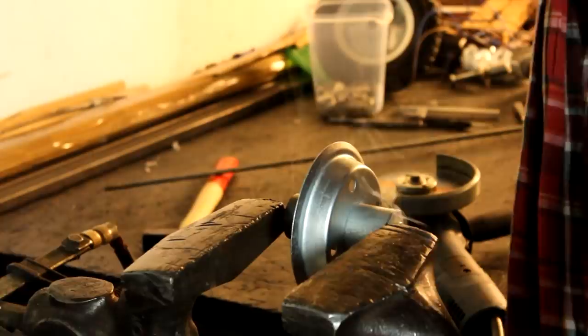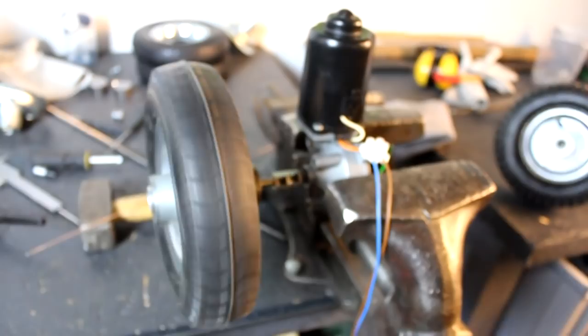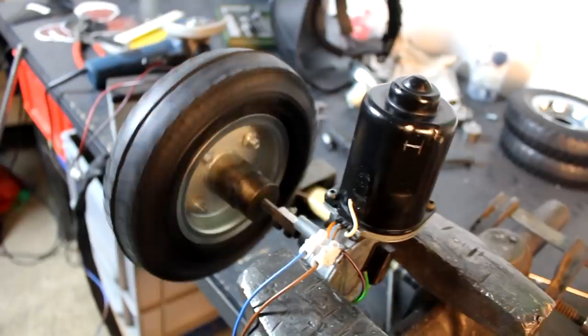And this is really all we need to transfer the rotation from one of the motors to one of these wheels here. But of course, this little connector piece is too flimsy and too wiggly, as you can see here, to act as a suspension. It really should only convey a rotational movement onto the wheels, while we have to build an actual suspension that will be inserted from the outside into the wheels, and that is what I'm going to build now.